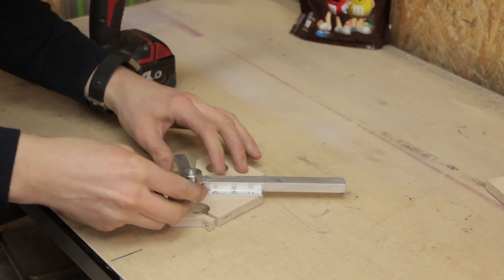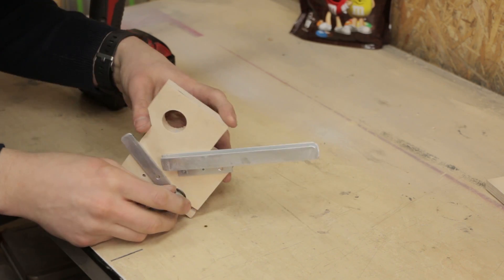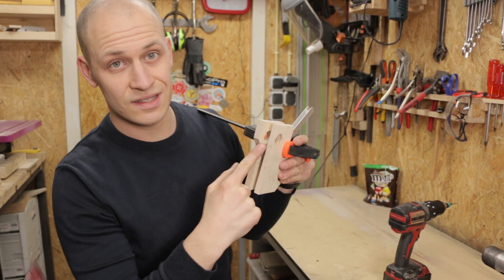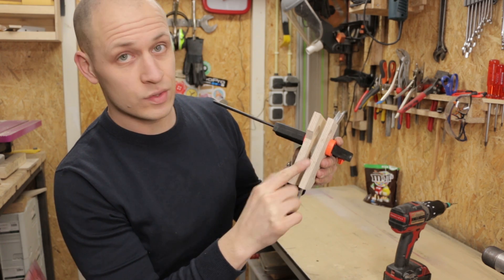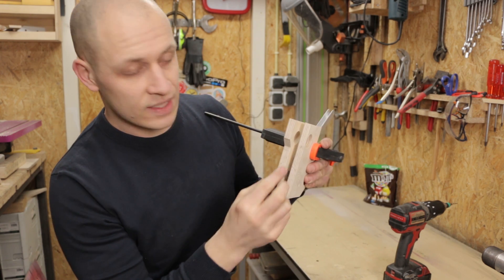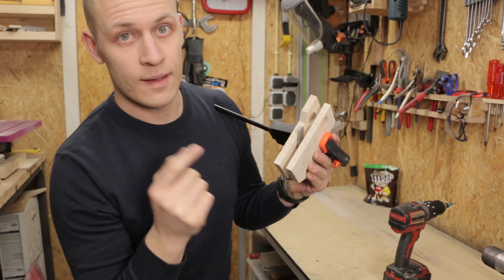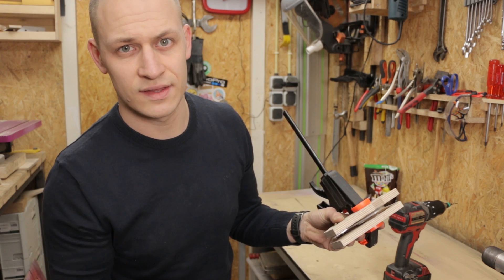So let's go. When placing this lever it's really important that it hits in the middle of the barrel every single time. To do that I clamp these two together on the barrel because that's the width in between, and then I can center it, tighten it and remove this plate again. But then I'll know that it's in the center — when you have only one plate it's a bit harder to measure that.